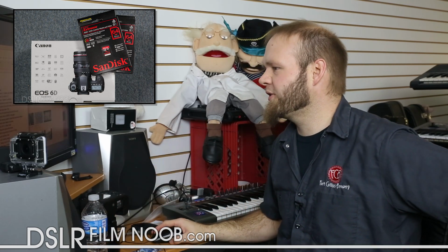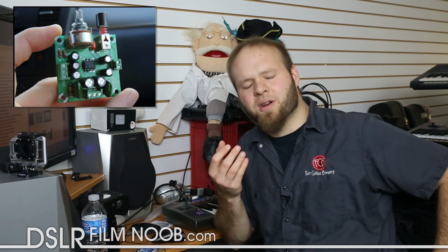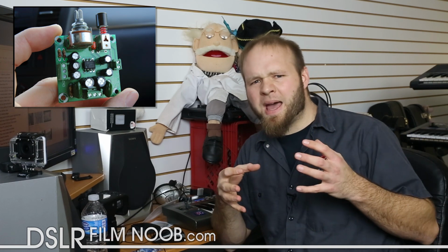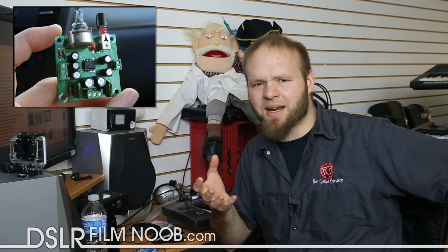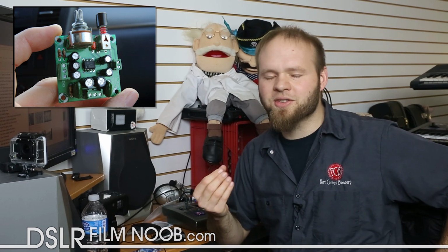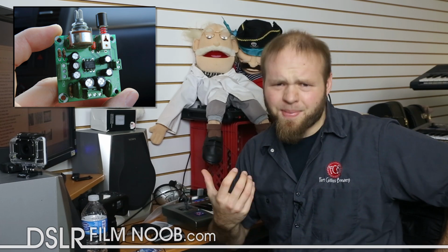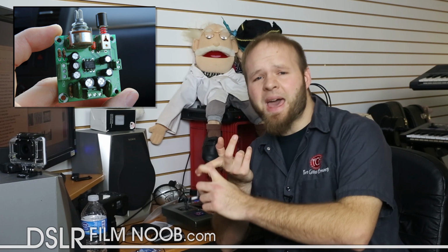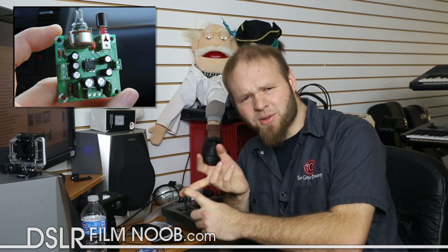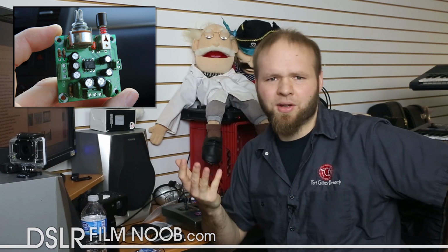Now, moving on from there, I did post an article about the DIY audio interface I'm working on. And I know a lot of you have chimed in on that iRig pre-hack that I posted earlier, and that's extremely handy for turning that into an XLR adapter for your camera. But I would like to see something that's in that price range that offers you 2 channels of audio inputs, and the ability to independently control the volume on those. Gives you XLR inputs, 3.5 millimeter inputs, and gives you a 3.5 millimeter stereo output to your camera.